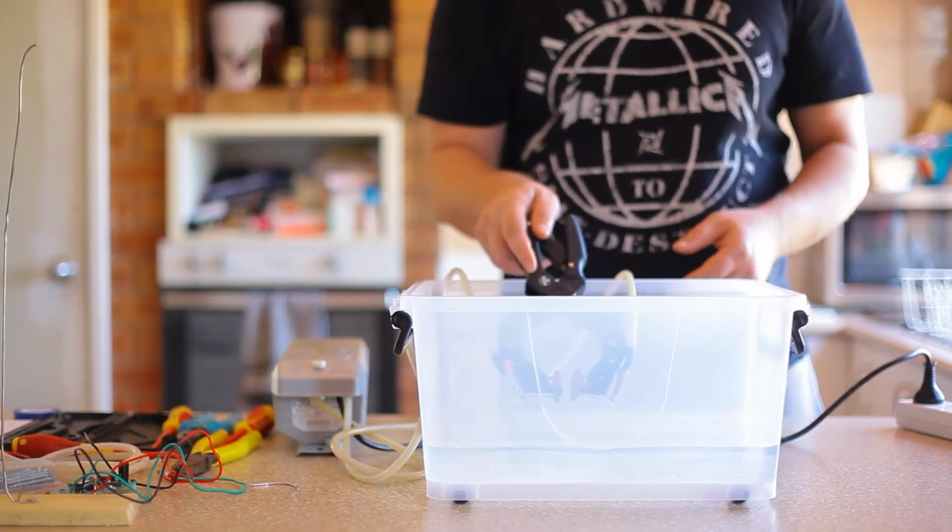Right, so by the end of it, I ended up with a maximum gap distance of nearly 2 centimeters. Now the usual dielectric strength for spherical electrodes, I suppose, is 3,000 volts per millimeter. With the needle probes, it ended up being closer to 800 volts per millimeter. This goes against everything I learnt in trade school.